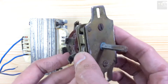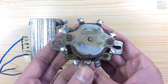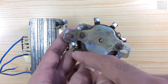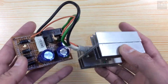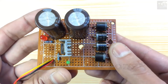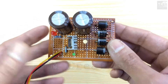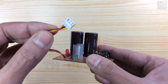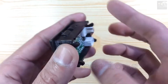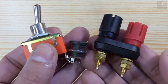This is a heavy metal type rotary switch taken from that old stabilizer, which has eight positions, eight inputs and one output. This is the variable voltage power supply port using the LM317T regulator and MJ2955 transistor, and a rectifier circuit for manual voltage output. A 7812 regulator IC is used to power the digital volt-ampere meter, which measures voltage and amperage. Also included are a 10 ampere switch, DC female socket, and DC banana plug.